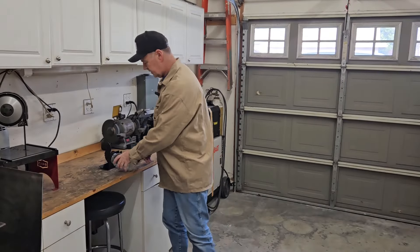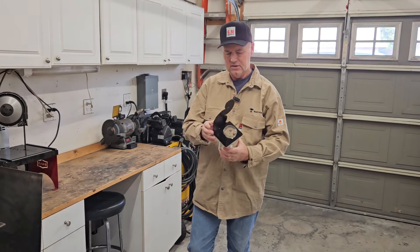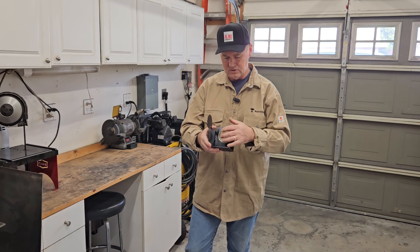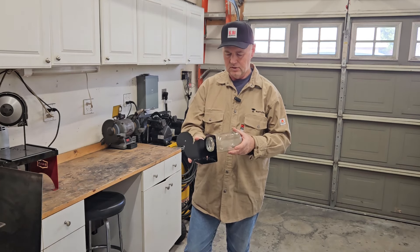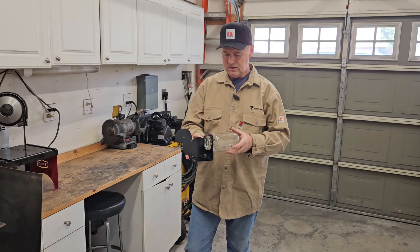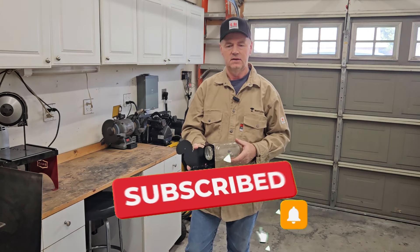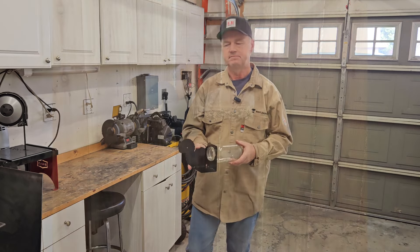The paint's dry. Squirrel feeder — narrow mouth mason jar, some 16-gauge sheet metal, drew it out in Inkscape, cut it out with the Arc Droid. I have to adjust my drawing since the mouth of the jar was a little bit wider than what I cut out — easy to fix. With a carbide burr, I opened it up and it seems to work good. The only thing left is to go stick it on the fence and see if squirrels will eat out of it, which I'm sure they will. If you enjoyed this, I'd appreciate a like and subscribe, and I opened up the store if you want to support the channel — follow the link in the description. Thanks again.